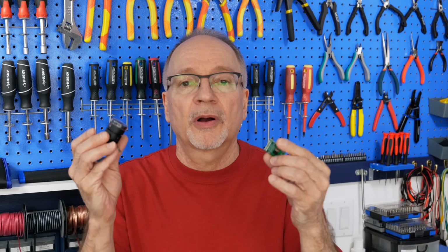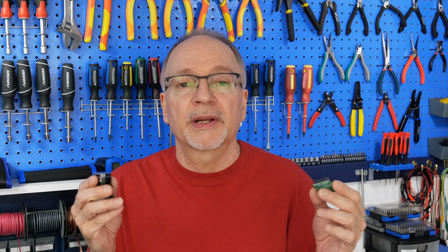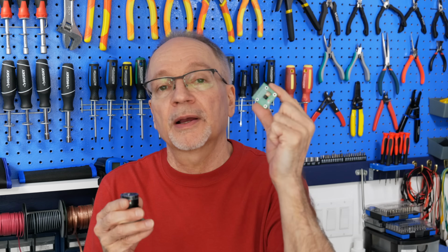Now, one feature of the Arduino Giga that I was not able to demonstrate to you today was the camera connection, and it wasn't for lack of trying. I bought a number of cameras from ArduCam that can be used with this board, and I followed the examples that Arduino provided, but I cannot get it to work, even though this particular camera here is the actual camera they use in their example, and I've got two of them, so I know I don't have any bad hardware here. I suspect the reason I can't get it to work is the fact that the library that I use is currently at version 0.002, and it's probably an alpha copy of something that was taken from the Portenta and still needs some work to work with the Arduino Giga.